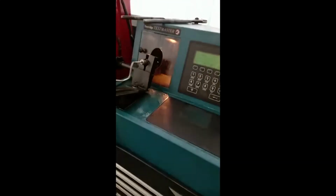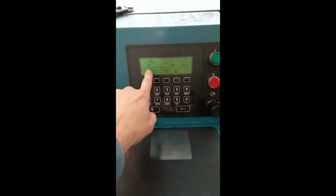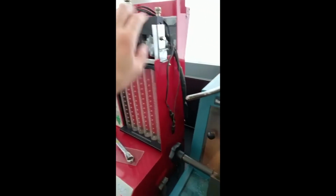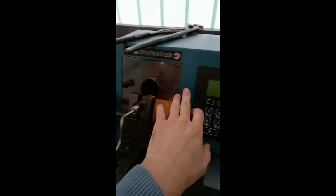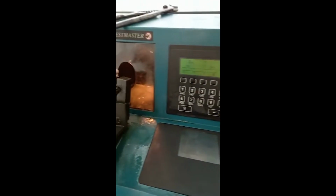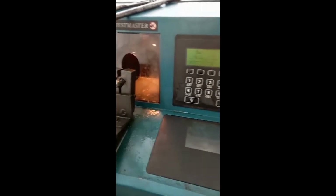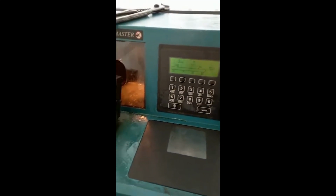I'm checking your injector. So this is our tester, and what I'm looking for here, as you can see, these old school injectors don't work like modern ones with a trigger. These ones work off air pressure, basically, or pressure. And what I want is for it to spray in between them bars. Now I'm not doing a spray pattern test yet. I may do that later, it all depends on time, but I'll show you how it works.